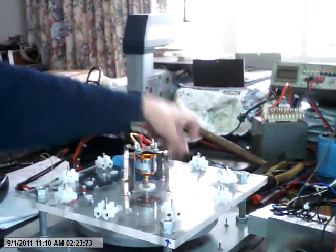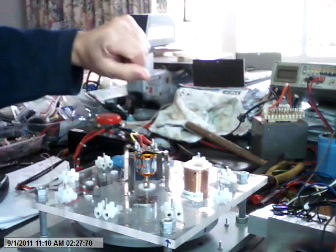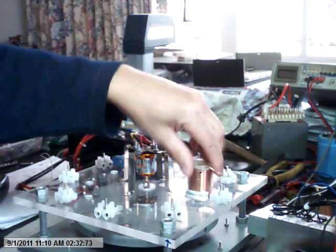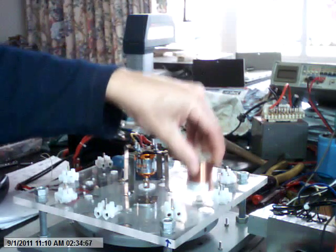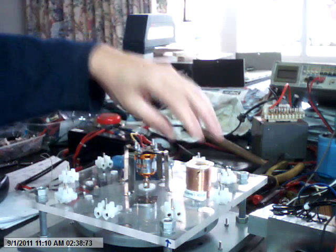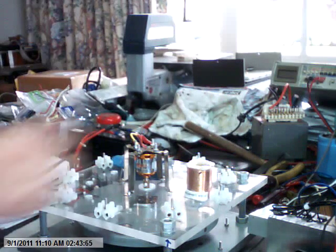I'm going to get rid of these 20mm magnets. I'm going to put my 10mm magnets in place with my iron laminated cores. I'm going to mount these coils here like this, top and bottom. I've also got some ferrite powder coming from the United States which I'm really looking forward to getting because I want to make some cores and customize some coils. So I'm looking forward to getting that up and running as well.